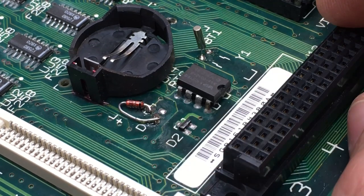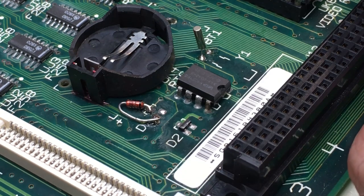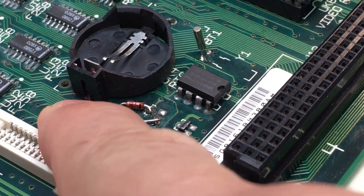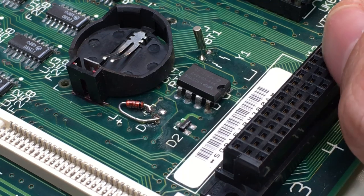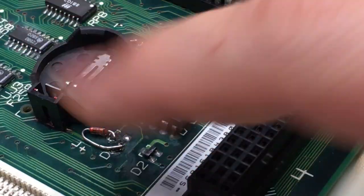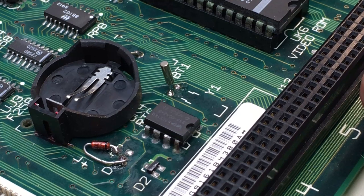So I just kind of hacked in just a regular diode there. Did a couple checks. Everything is fine. Continuity is correct. The diode works fine. In addition, this pad underneath this side was busted. I had to run a through-hole wire patch through that and do that. This diode tested just fine. No problems there. And then while I was cleaning up the area, the clock crystal fell out. It fell out. It fell the heck out. So I had to resolder a new one in there.